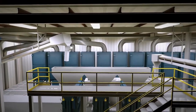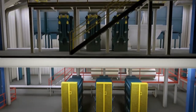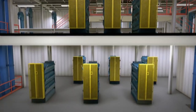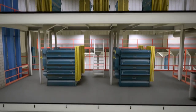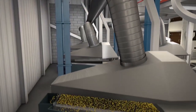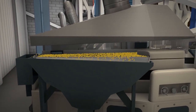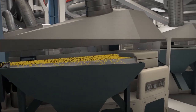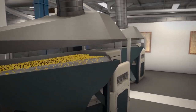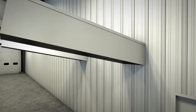The seed is now gently moved to the sizers where it is separated by size. Uniform seed size contributes to better plantability in our farmer customers' fields. During gravity separation, seed is separated based on density and lighter product flows to the discard side of the machine. Gravity separation ensures that only higher density and therefore higher quality seed is kept.